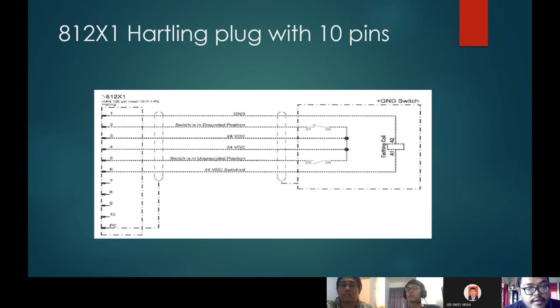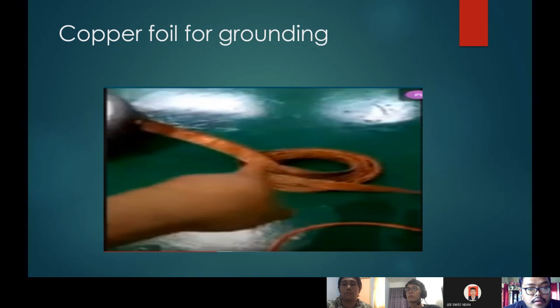To avoid a ground loop between different grounding points, the KIT is grounded at only one position through the grounding rod. The rod should have a ground resistance of less than 2 ohms. If the resistance of the soil near the factory is known, the first 3 meters of rod below the soil level have to be insulated in order to avoid picking up surface current. The two rods are connected with parallel copper foils of 150 mm times 0.3 mm cross section for this example in the picture. This procedure is repeated until a ground resistance of 2 ohms is achieved.